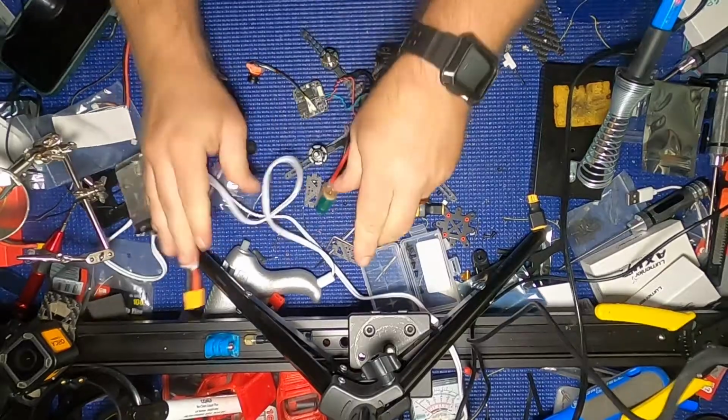Oh, I don't know if you just saw that, but I did a big no-no. Big no-no. And I knew better. I absolutely knew better. Make sure when you plug it in that you have an antenna on your VTX. I lucked out. I absolutely lucked out. Don't know how. But yeah, I lucked out. So I put the antenna on my Ghost receiver, and I completely forgot to put it onto the Shark Byte VTX.